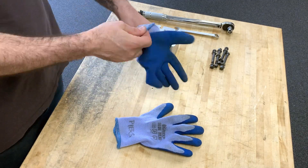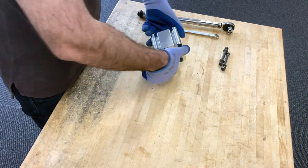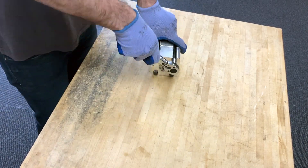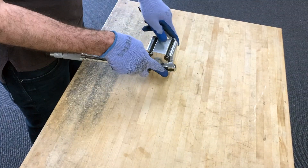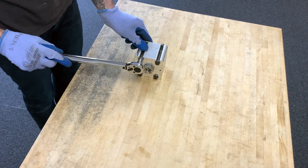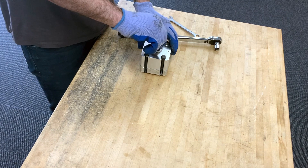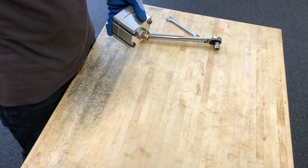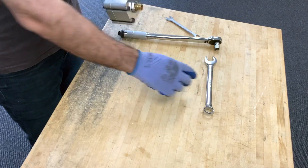In the meantime, we will get prepped — safety gloves on, put the bolts in the mould and tighten it up. This particular tool is made by Easy Moulds in Germany. We use a torque wrench for consistency and a half inch BSP fitting which screws onto the end of the barrel. We may look at a quick release with future moulds, but for the time being this one suits just fine.